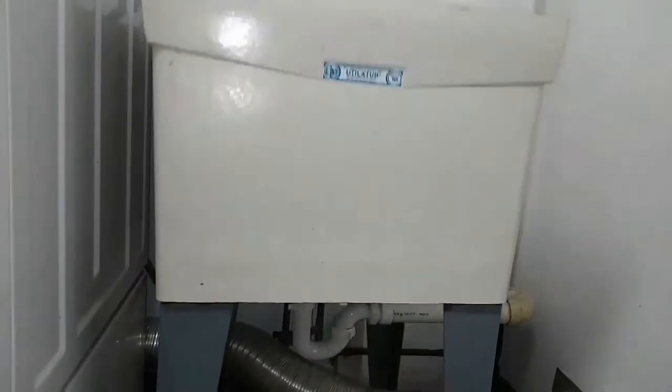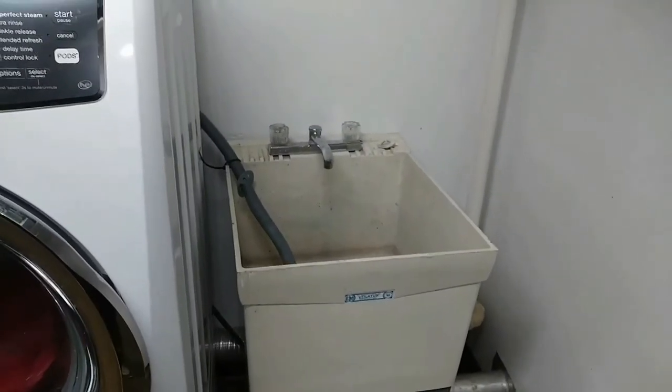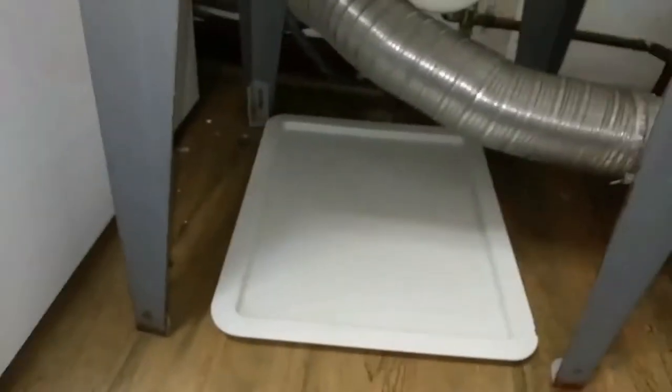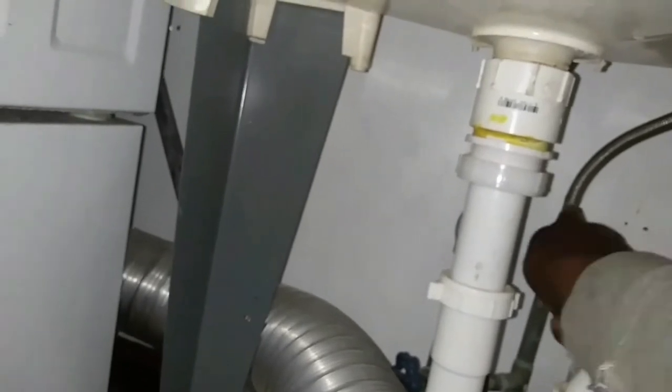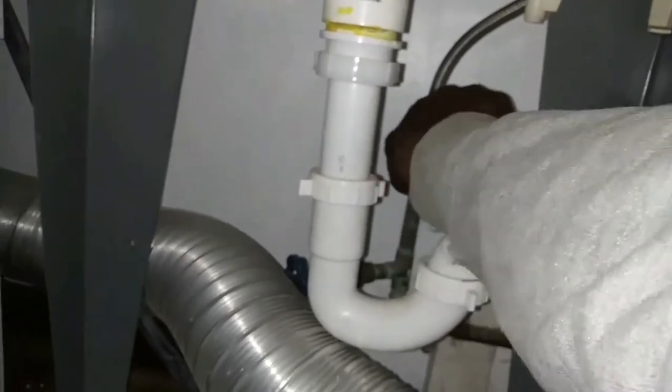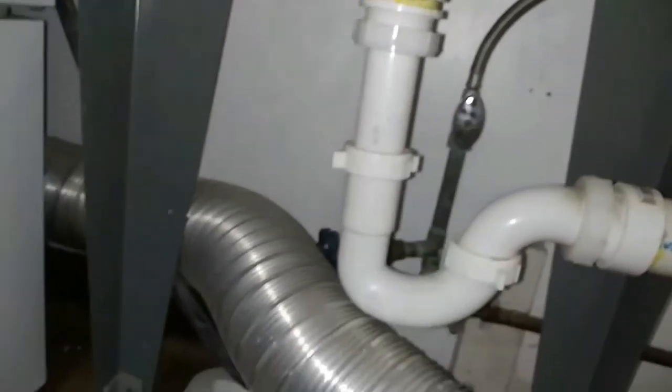This is the old sink, and the faucet is broken on it but she just wants a whole new sink. So I'm going to install this new sink and use this tray to catch any water that may leak — I want to make sure you do that. The first thing I'm doing now is turning off the main cut-off for this sink, hot and cold.